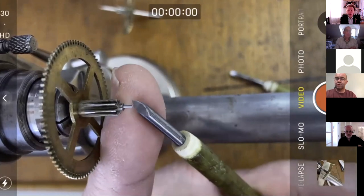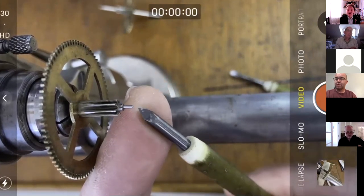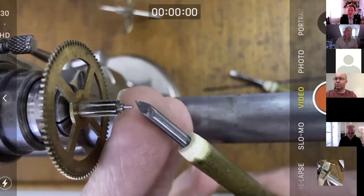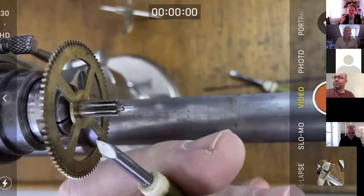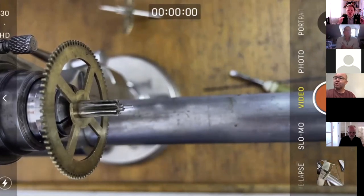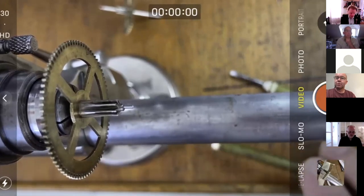I also have been experimenting with some relatively inexpensive pyramid-shaped carbide engraving cutters, and these are really good. I don't know whether it's the grade of carbide. It probably is. I should probably stop cheaping out and buy some slightly more expensive ones. But the edge of this graver, with the diamond sharpening stuff I've got, you can never really get it to be a nice sharp edge. It's always chipped. So it cuts like crazy, really good for removing material quickly, but leaving a poor finish. And obviously all carbide tooling isn't like that, so I'm doing something wrong. So if any of you are in the machine turning industry or have more experience, let us know in the live chat where we're going wrong. Great for removing material, but relatively poor surface finish.